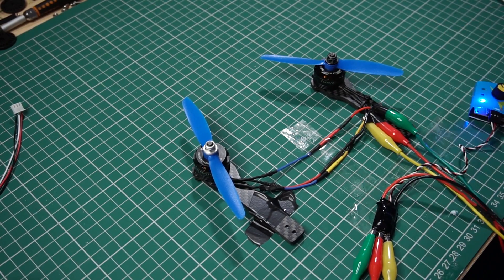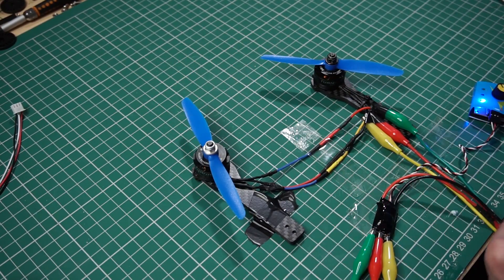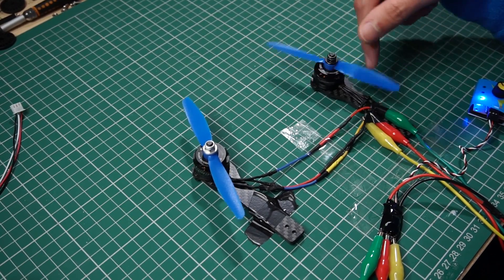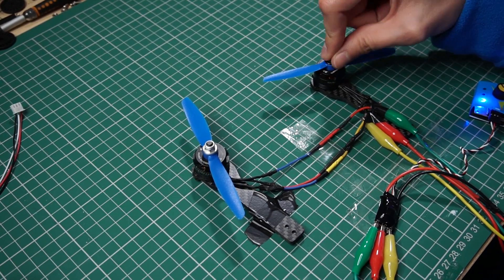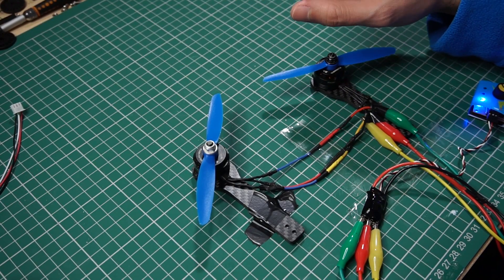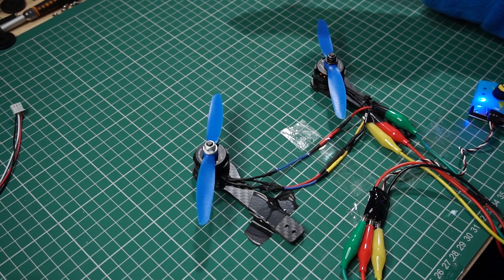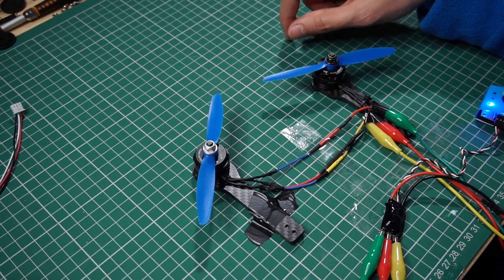The ESC is detecting the timing signal of one motor at the same time as running the other, but there is an error because one motor is stopped. So the ESC sees the error and decides to stop. This is clearly not a good idea for an airplane configuration — if one motor stops for any reason, the other will stop as well. And even if you manage to avoid that problem, there's still an efficiency issue because both motors consume amps through the same ESC.